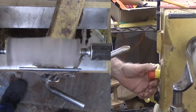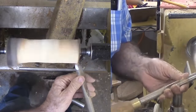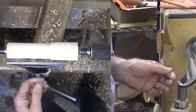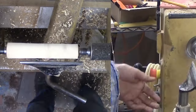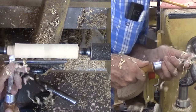On to the top and bottom finials. This is an apple branch that I cut over a year ago. At that time, I sealed the end grain with Titebond 2 and put it away to dry. Nice — no cracks. There are insect holes, however. I do not know when the insects ate into the wood, but no problem. I cut all that away and end up cutting a tenon.